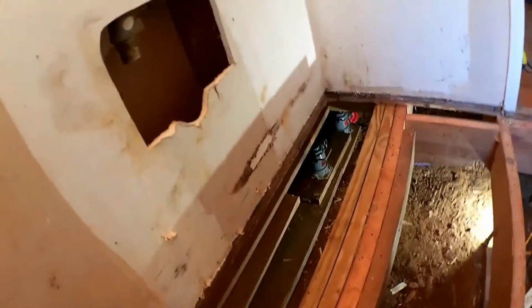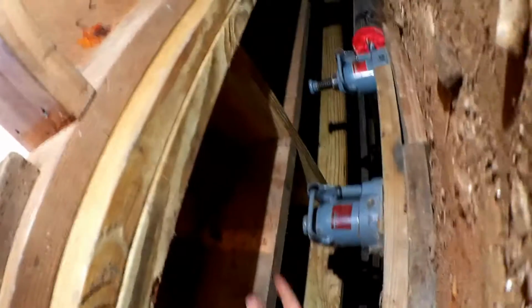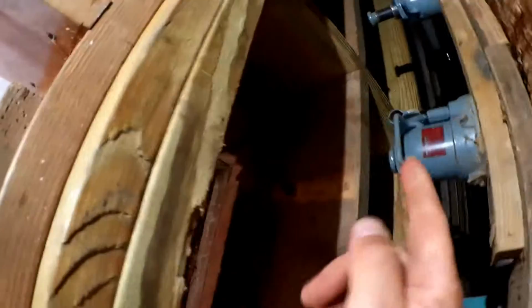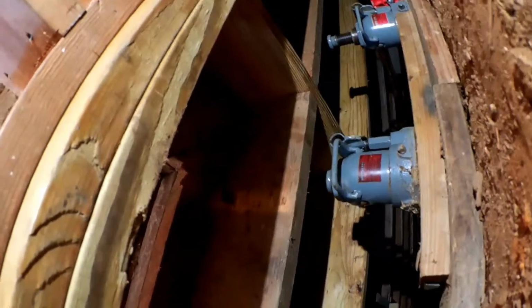As you can see, I've got my jacks in place now, ready to lift this entire joist and wall at once. Got a cross member in there to fasten when we get it where we want it, with some hangers, and I got to put another one in on this end here. So I'm just gonna cut it back to here so I have a little room to work around this pipe.